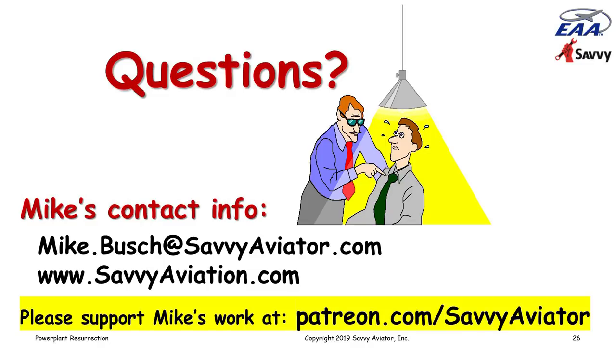Larry's wondering, can that CamGuard also be used with Aeroshell 15W50, the multi-viscosity? It could. I don't recommend the use of Aeroshell 15W50. For my clients who need a multi-grade oil because they operate in places where it gets cold in the winter, I recommend that they use the Phillips XC 20W50 and add CamGuard to it. Adding CamGuard to Aeroshell wouldn't hurt anything. It's just that I don't like Aeroshell 15W50 to begin with. It's 50% synthetic oil. We know that synthetic oil doesn't work very well with leaded fuel.